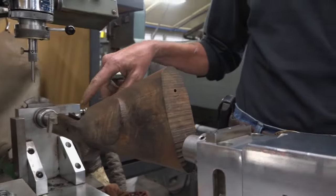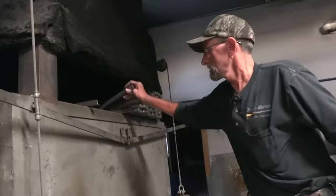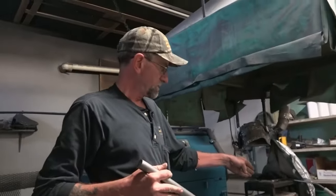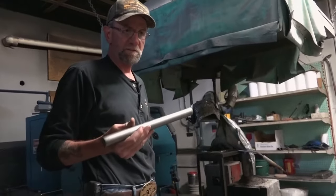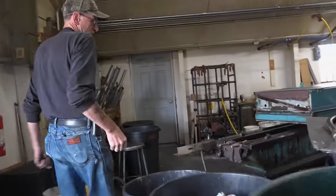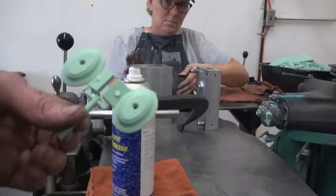You have a master, from carved hardwood. We start out with virgin bars of 4140 chromoly, and molten steel. This pot here will melt 30 pounds of this every 4.5 minutes. Kirk Bryan took time out of his very busy day to give us a fascinating tour of the factory, beginning in the foundry. Those will be grip caps.